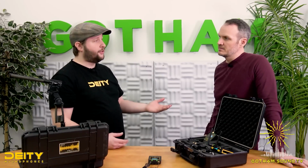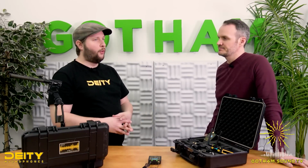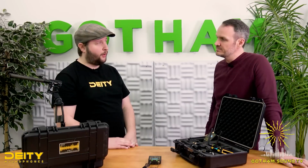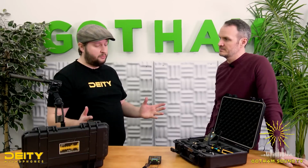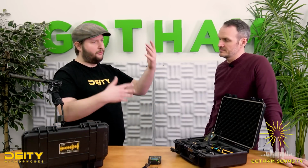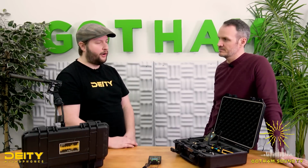Well, again, it depends on distance. Right. So the test that we've done is I set up at 10 milliwatts and we were still 65 feet away from the subject, getting more than enough signal. We had 0 hiccups. We had a couple of pieces of grip and lighting equipment in front of us with grips walking back and forth, not a big deal. And at 65 feet, we were on for about 4 hours and our battery bar didn't even move. So we got a lot more battery life.